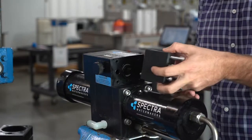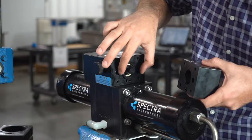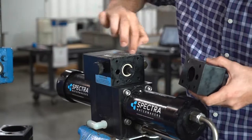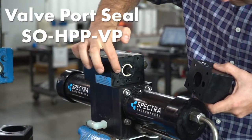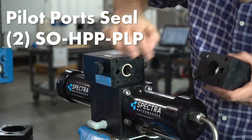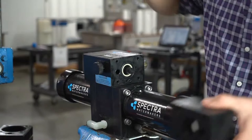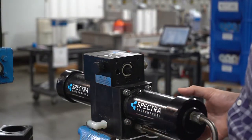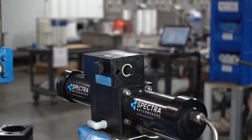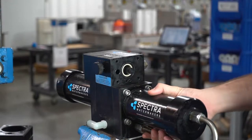Once you take this off, there are about five things that you don't want to lose in your boat. There's a spacer ring here, there's an O-ring around there, I'm going to leave it there. There's an O-ring right there and there's two O-rings at the bottom here. The reason I took this off is because your feet here make it hard to pull off the cylinder.